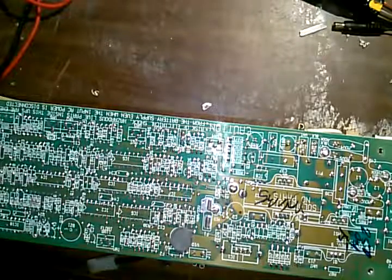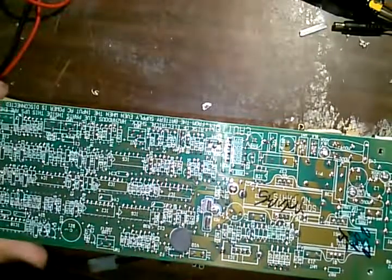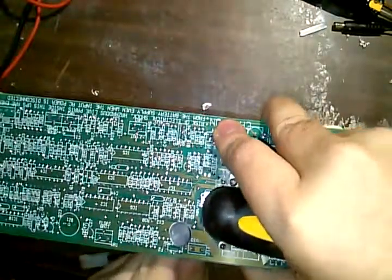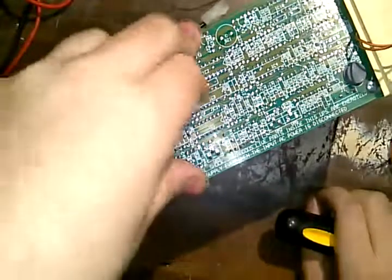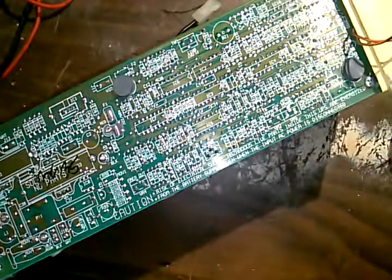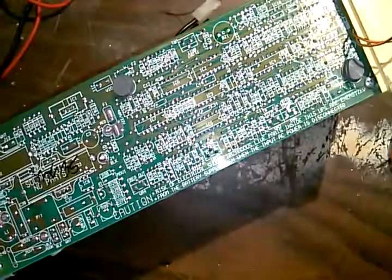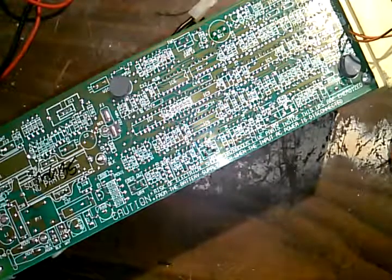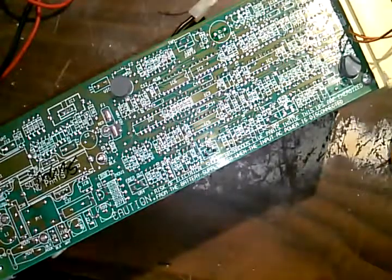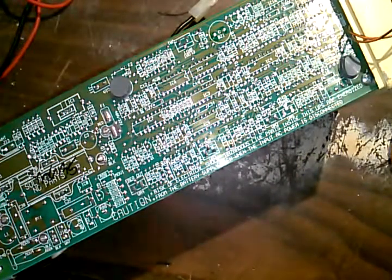When these batteries get hot, and since you've already cut the seal, they're going to start off-gassing a lot more than they normally would. And remember, they're off-gassing hydrogen along with steam from the water. They'll even bulge. Batteries that bulge are usually the ones that still have their seals intact and developed a short so bad in the cell that they get hot, the plastic becomes malleable, and they start to flex and bulge. You can probably imagine what kind of wonderments happen from there on out. There's a number of things that can go down.